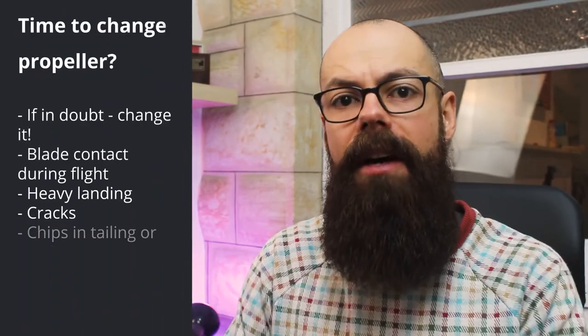Lastly, if your drone has flown for approximately 300 to 500 flight hours, it is time to swap out the propellers. Some propellers will give out without any warning sign if they have been used for more than 500 hours. If it's 500 hours and it's been a couple of years, just replace the propellers. You can find them online for as little as 10 to 25 dollars, and it is completely worth it to keep your drone safe. Keep track of flight hours and between 300 to 500 hours or one to two years, whatever makes you feel comfortable, make sure you swap out the propellers.